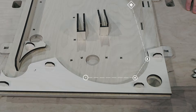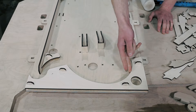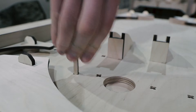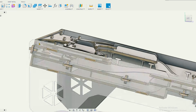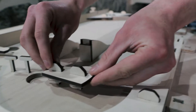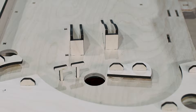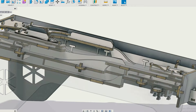I wanted the ball to go from the left side to the right one, and I wasn't sure what this arc should look like in order for the ball to roll smoothly without losing its momentum. In case it did lose momentum, I placed pop bumpers right here so the ball could bounce into the hole and surprise you when rolling out from the basement. There were two main tasks for this component: first, it had to lead the ball into the hole if it didn't have enough momentum when entering this section, and second, it prevents the ball from rolling into the doomed area.